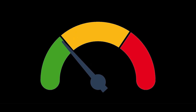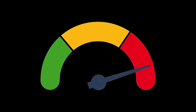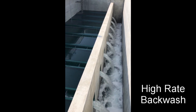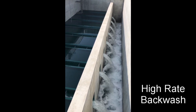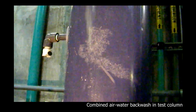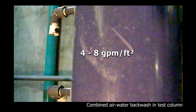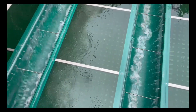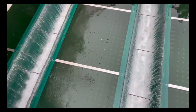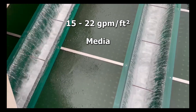What I haven't discussed before is its performance over the range of flow rates that operators utilize. Let's focus on water backwash, though problems with varying air scour rates are similar. Tango Uniform has an upper and lower conduit for air and water respectively. During combined air water backwash, water flow rates are commonly four to eight GPM per square foot. Afterward, during the fluidizing rinse, flow rates are three to five times as high — perhaps 15 to 22 GPM per square foot — depending on the media, water temperature, and other factors.